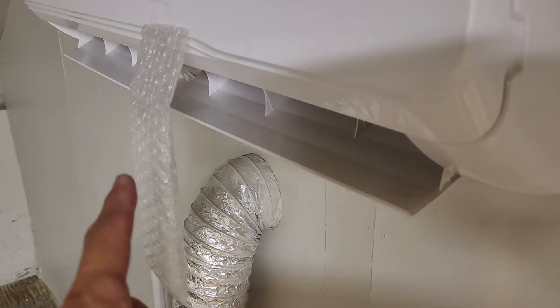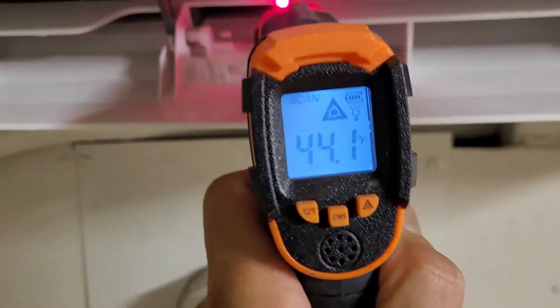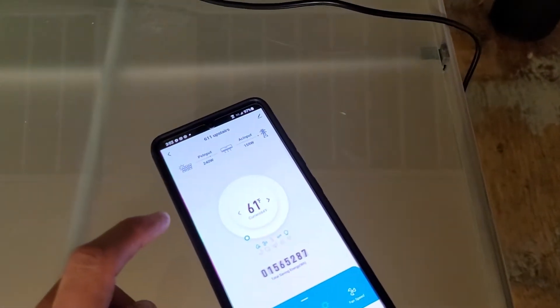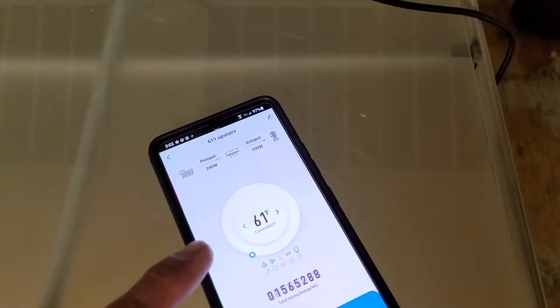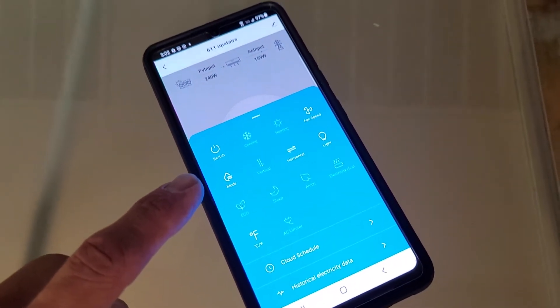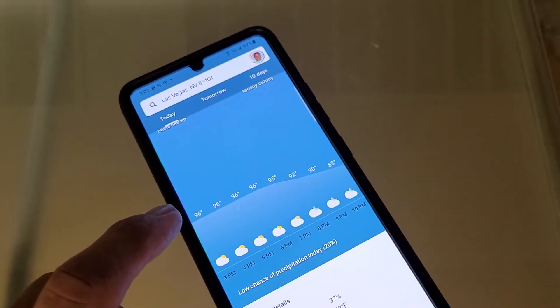You'll see that there's very little airflow coming out of here right now, but meanwhile the coil is pretty chilly at 45 degrees. The space is around 84 degrees, so this unit is purposely undersized — it's the only thing running in a 3,000 square foot building. The power here, adding up the solar versus the AC, is around 400 watts. This mode is on the dry mode icon, not the cooling mode, and the conditions right now are 37% humidity and 96 degrees.